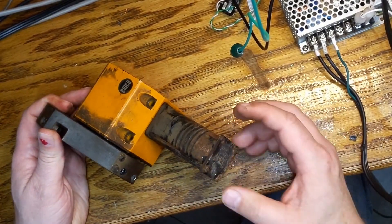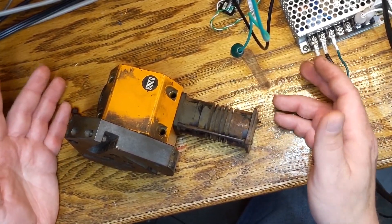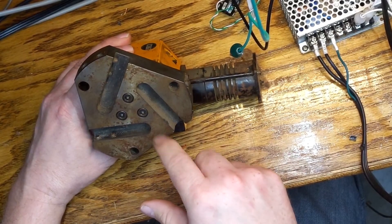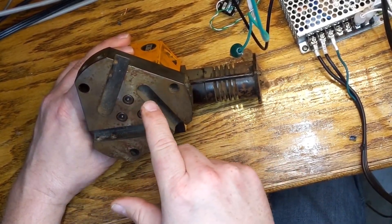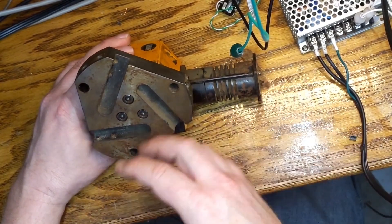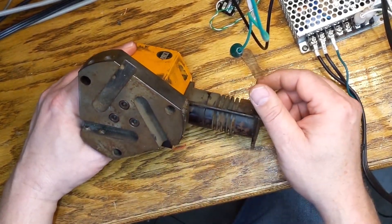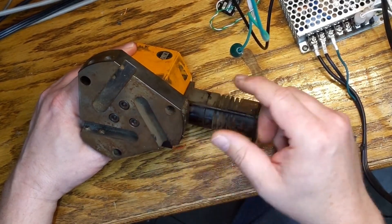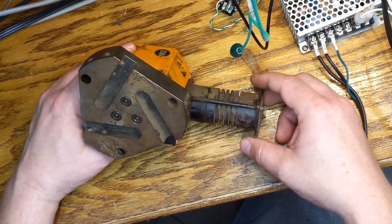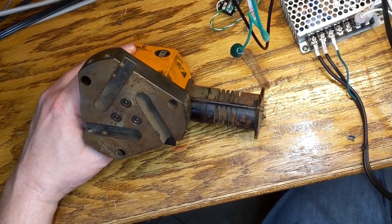I think I'd like to make some of these at some point, but I'm gonna use it as-is. I see a lot of people put a stepper on here, but honestly the way this works it's perfectly fine. It'll use just one output — for one direction, finding the next tool, it runs at 24 volts forward, and then the output goes low, it runs backwards until it hits a pawl. I've kind of had this apart. Somebody fixed it — I think they broke the pawl.